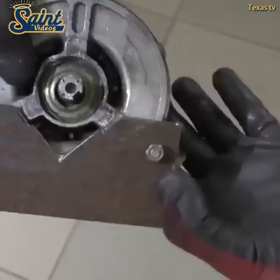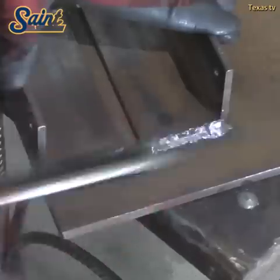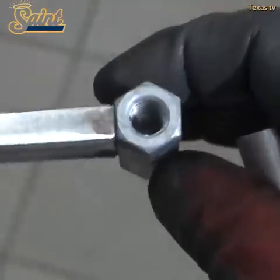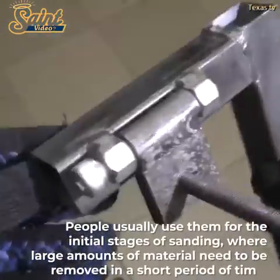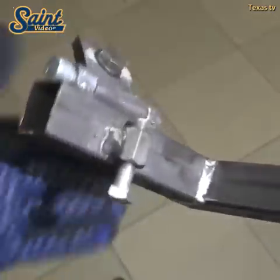It's a tool whose primary purpose is to remove large materials from a workpiece. It consists of an electric motor turning two drums fitted with a sandpaper loop. Belt sanders are generally robust and capable of working with a large surface. They are suitable for the beginning stage of shaping and finishing wood. It is mounted to a workbench and the material requiring shaping or finishing is held against the sand belt as it turns.